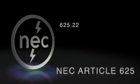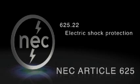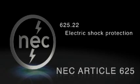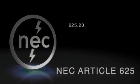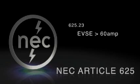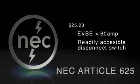625.22: The EVSE shall have a system of protection against electric shock. Standard ground fault circuit interruption equipment, or GFCI, does not provide the range of protection needed for the various types of charging systems. 625.23: For electric vehicle supply equipment rated at more than 60 amps or more than 150 volts to ground, a disconnecting means shall be provided and installed in a readily accessible location.